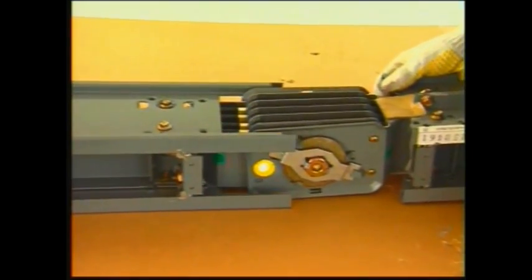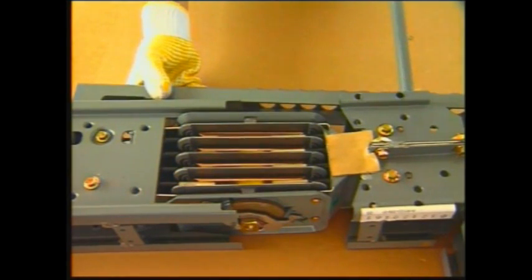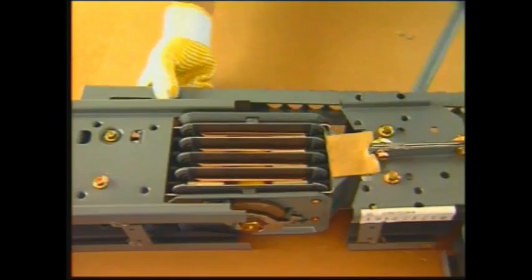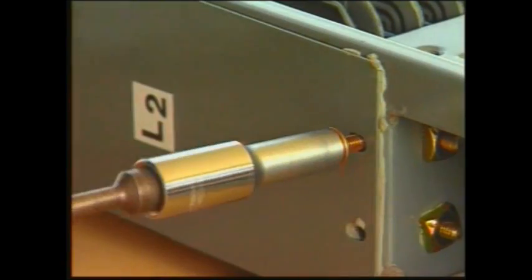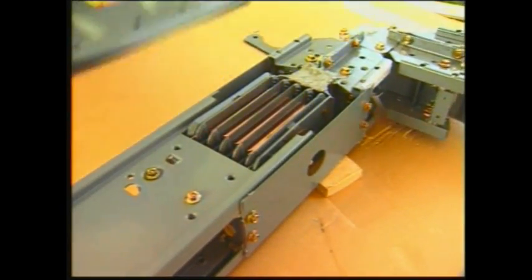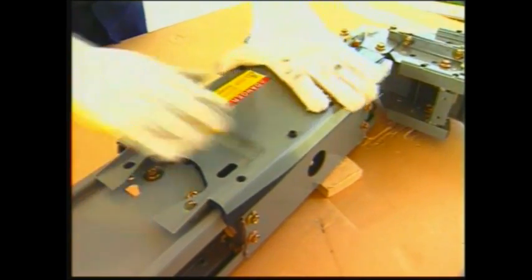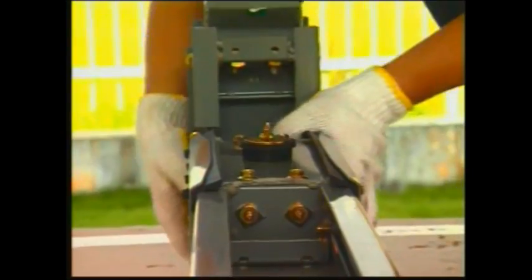Slide the busways together. Tighten the visible bolt. Then put the protective cover on after removing the protective cover from the sealants on the center edge of the duct side. Tighten the bolts, and then put the tie channels on. Tighten the tie channel bolts.